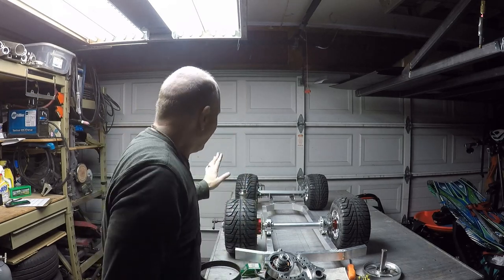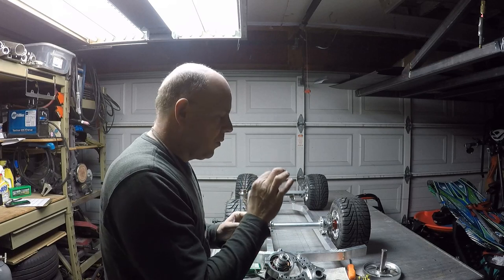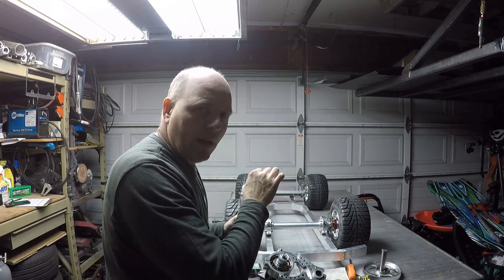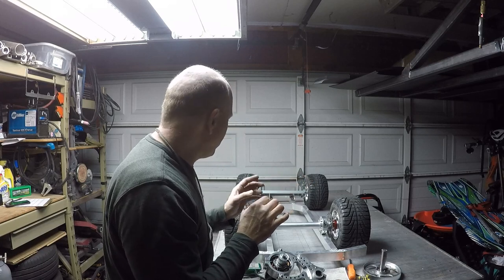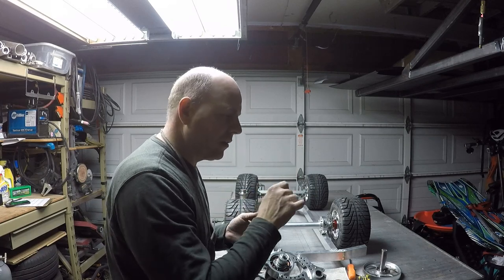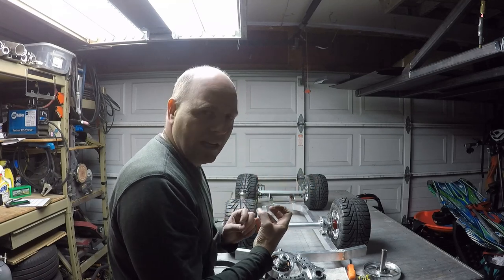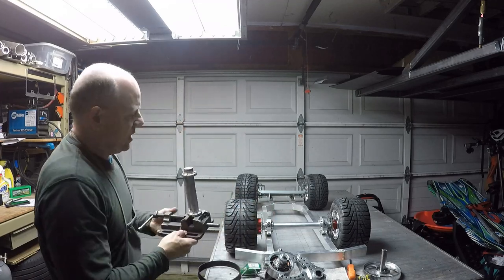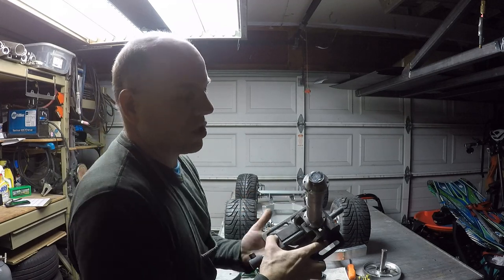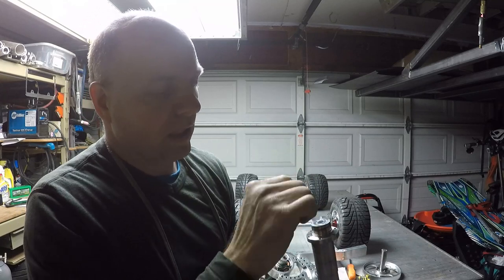I'll leave the weld to cool. Very little filler rod is needed — I use filler rod to fill the keyway slot, then do a fusion weld around the surface, always going around twice. The first pass fuses it; the second pass, nice and slow, gets depth into the weld and properly preheats the material to prevent a light crack. The surface weld turned out pretty well. I'll dress the edge and let it cool while I continue working on the bearing tube.